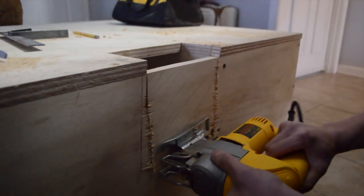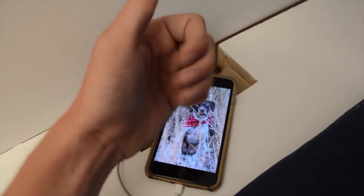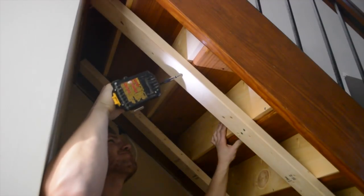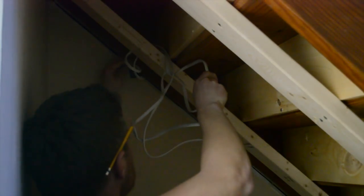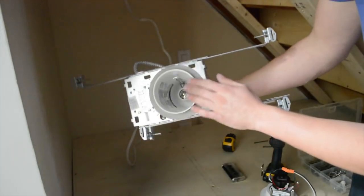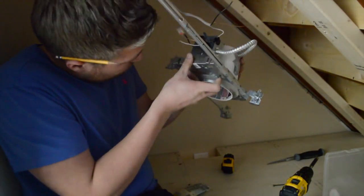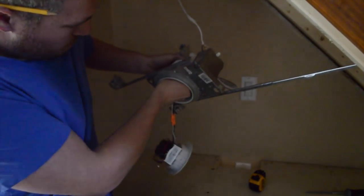This compartment will be pretty nifty for charging your phone. Adding the studs under the stairs is pretty straightforward — I used the leftover 2x4 from earlier. Fishing the wire over the studs will make it easier adding the recessed lights and hooking everything up. This recessed light was super simple to wire — everything was labeled. Simply push the wire through and you're hooked up. You can find these in the description below. Screw the bulb in, flick the switch, and you got light.